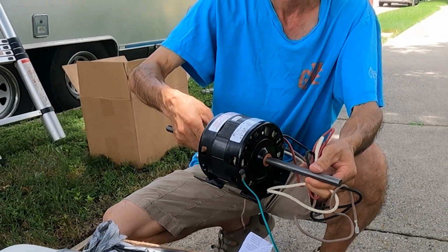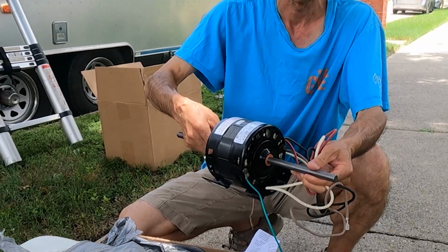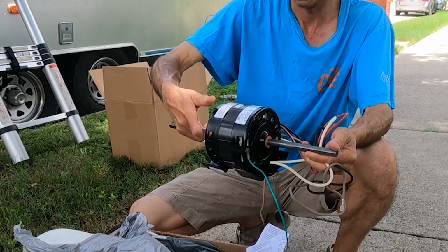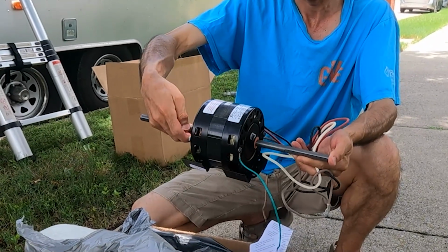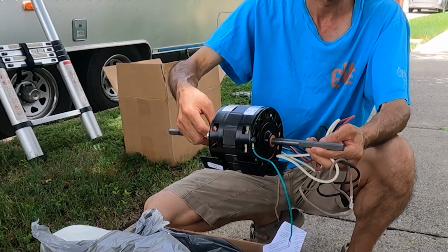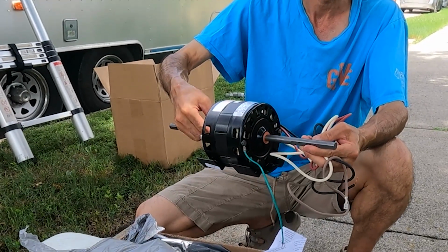That motor is 3.1 amps. Yep. So the old motor was, I think, less, and so we'll watch and see. You need to know the shaft lengths on that motor, and you also need to know the shaft diameter to be ensured that we can reach the fan and the other devices, and that is the right shaft diameter.